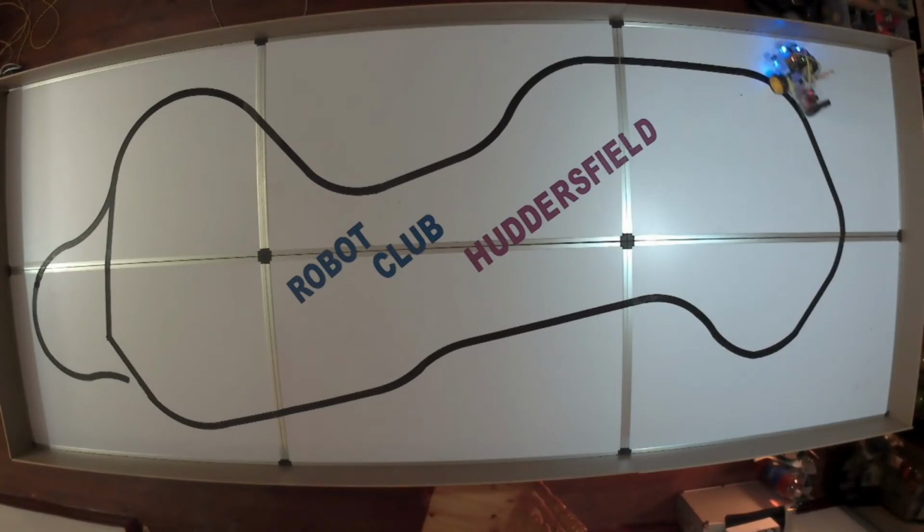If you look at it, I think what's happening is that the sensor's triggered there, which gets it to go backwards and then pull the left motor. Then as it comes back in, the time of flight sensor is tripping and going straight back. So we're getting locked into what looks like the same movement each time, and what we perhaps ought to do is pull away and potentially go right as opposed to going left. So I'll grab the robot.